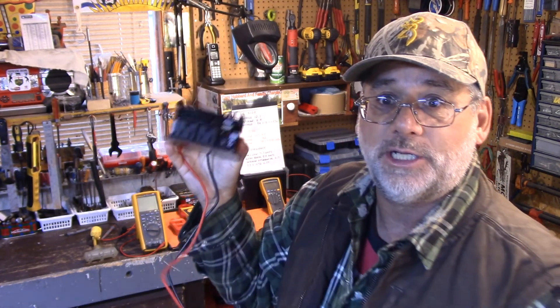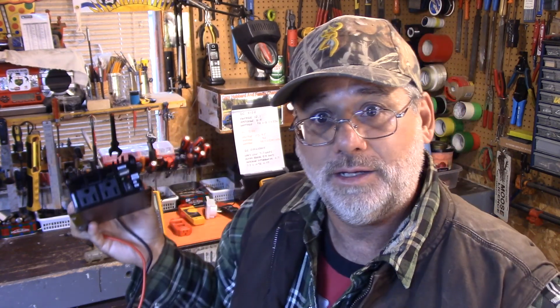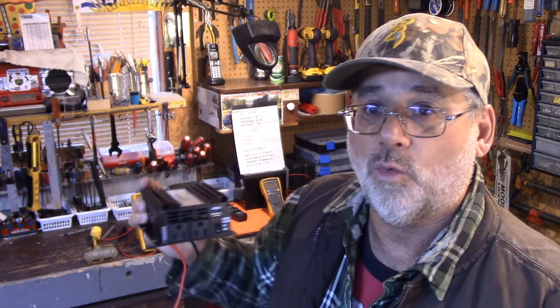If you're looking at this particular inverter, it's a 300-watt inverter — that's 150 watts a side. We loaded it up pretty well on one side, because it was 94 watts. I predict you would not get as much of a loss at a lower wattage amount. What I've noticed with inverters is as you load them up more, you'll get more of a voltage drop and more of a loss.